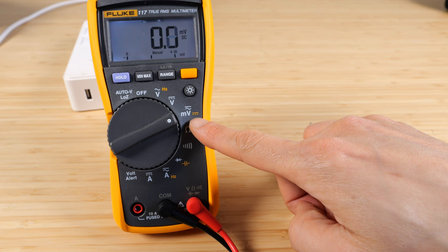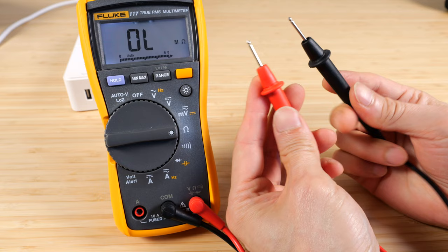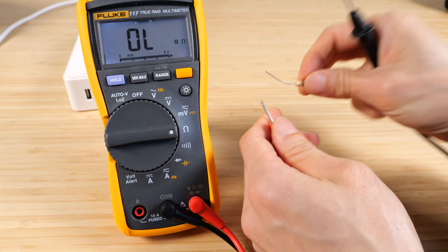This is when you have very low AC or DC voltages. So let's measure that: 10.7 ohms. At this point, we can measure the resistance of the leads too — it's 0.2 ohms. So we know when we measure this resistor, we've got to subtract 0.2, so it's really 10.5.